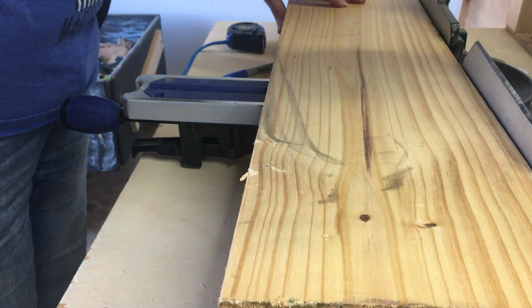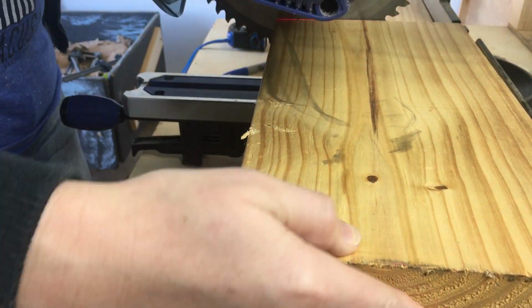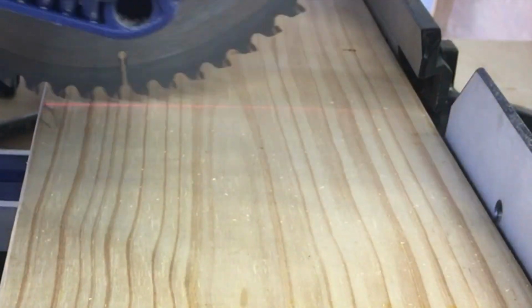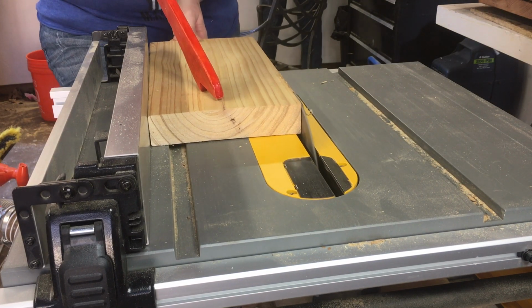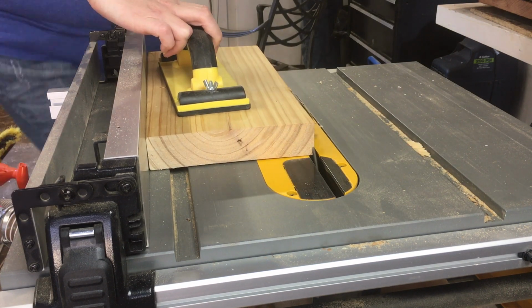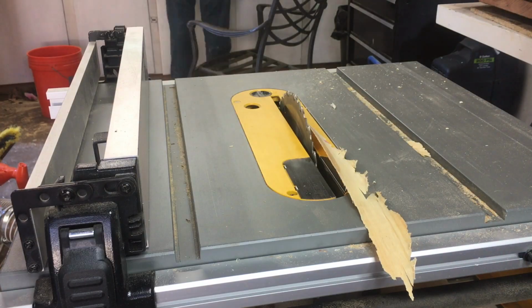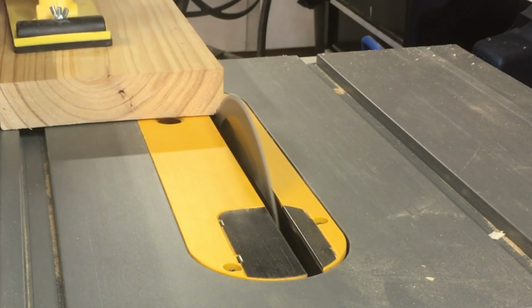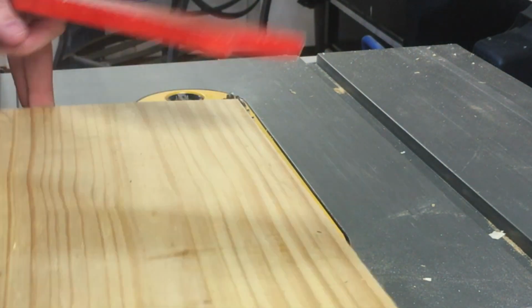So this slides right in with your cutting boards, or just stays right underneath your Instant Pot wherever you store it. I started by grabbing a piece of scrap wood I had laying around that was pretty wide, so that when I cut it would be at least 11 inches wide, which was the diameter of my Instant Pot. Then I took the two pieces over to the table saw and trimmed up their edges, because when you buy wood at your local home improvement store, sometimes the corners are a little rounded over, and I just wanted it to be nice and flat, so I trimmed off the edges.